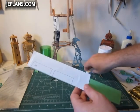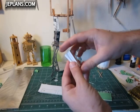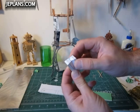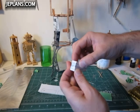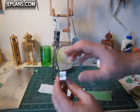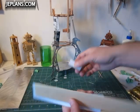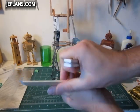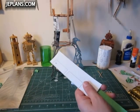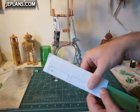For the drive mechanism, I'm actually going to make a bellow, similar to the bellows on player pianos. This was a test prototype. I needed to have a little more range of motion so that the middle range, where I want it to operate with the least stress, is where it's going to function. I'm going to make it from a thinner piece of wood than I used in the prototype. Initially I'll just cut out both sides and cut in my opening to connect to the air tube.